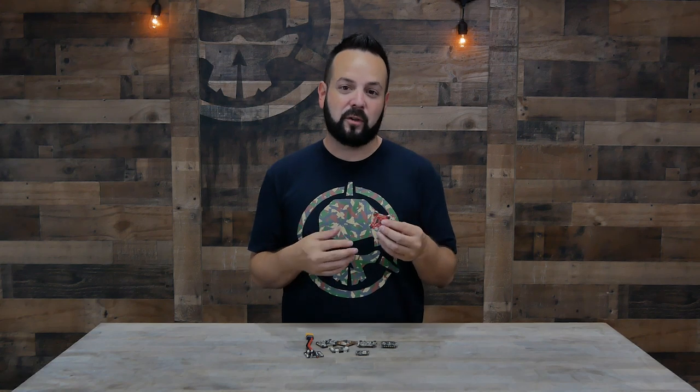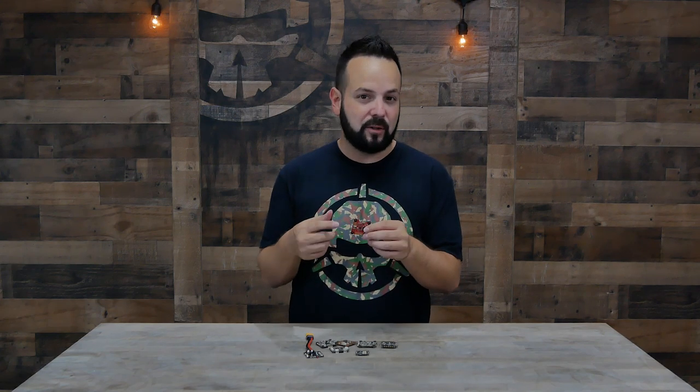The first main spec of a flight controller is whether or not it's all-in-one. As I've said before, all-in-one isn't really the best word because it doesn't do everything — it really just does two things. An all-in-one flight controller is a flight controller and also a power distribution board. Not only is it controlling the way the quadcopter flies, it's also distributing power from the battery out to the ESCs. If you're running a four-in-one speed controller, this isn't really a necessity.